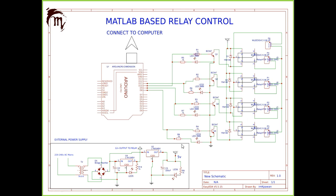The 5-volt circuit is self-sufficient to power up this module and you can control the relay fine. If you want to make this a standalone project and you have a 12-volt relay, you need to design an external power supply. This circuit includes a 9-0-9 step-down transformer, a bridge rectifier, a capacitor, and a 7805 regulator to power up your Arduino UNO. This is connected to your computer directly, so you only need this much to have power supply to your 12-volt relay.